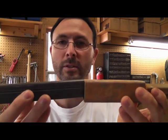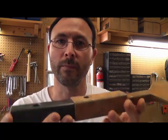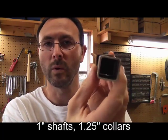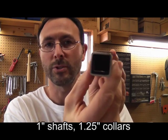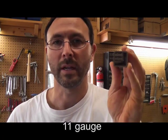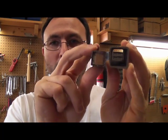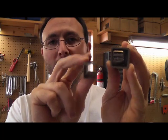The square steel tubing is a simple slip fit. However, there are still some disadvantages. First, there tends to be play between the one-inch and the one-and-a-quarter-inch, and this can cause your drill to wiggle a bit. That's to be expected, but obviously the tighter the fit, the better. The other issue is the gauge itself. Hydro Missions uses 11-gauge square steel tubing — it's nice and thick and pretty good. In the field, however, you may find stuff that's very thin and can bend, especially when you do a long run over 10 feet. Make sure you spring for the heaviest gauge you can find.